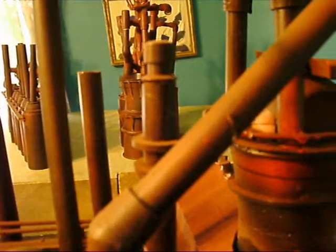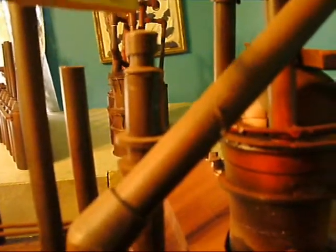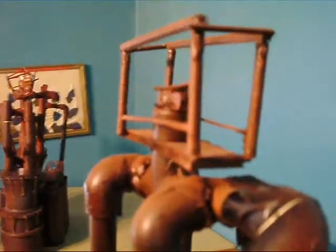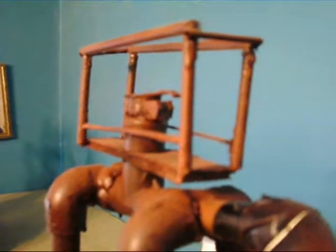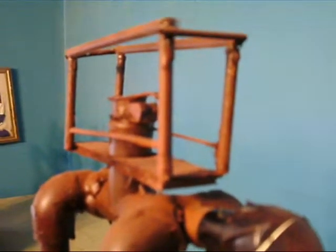This here is a flaring tower where flammable gases they can't use — rather than dump them in the atmosphere — get burned off. This is an explosion valve up here; all blast furnaces have that just in case the pressure gets too great, it's supposed to stop the furnace from blowing up. Then this here is the slide for the skip hoist hopper or bell hopper.